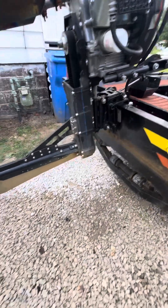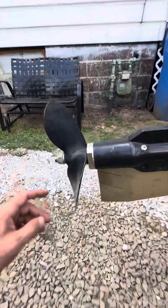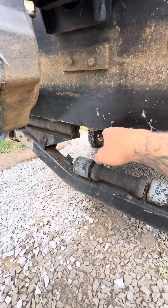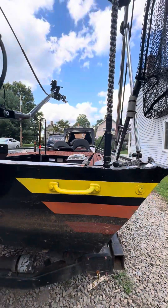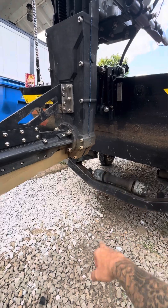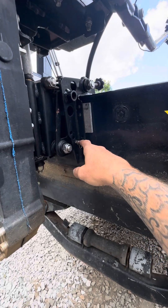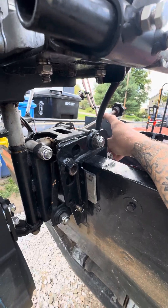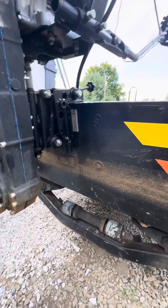The other thing I've seen guys asking about: to get these things running true and as fast as possible, the prop nut and the bottom of the back of your boat have to be the same height off the ground. Put a level on your boat, make sure it's perfectly level, then measure from here to here and from here to here. You can adjust it at the four holes here or on this bracket. Mine's bent — I just got as close as I could, about a half inch off, and I'm still cruising at around 27 miles an hour.